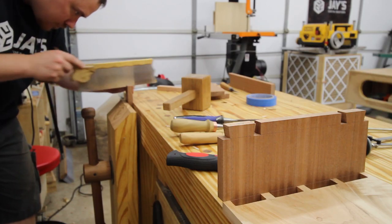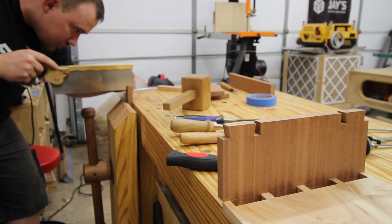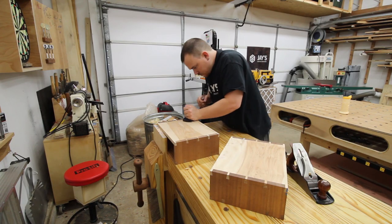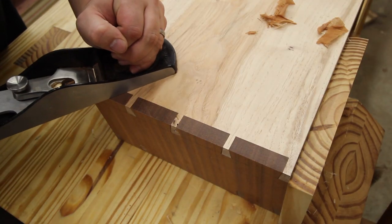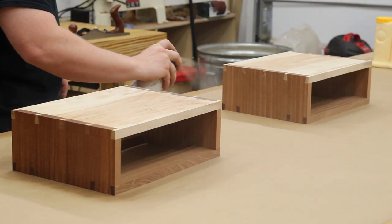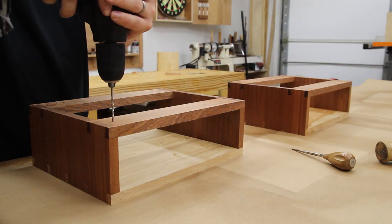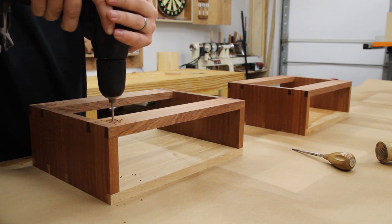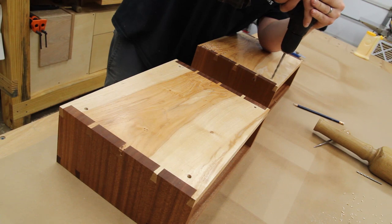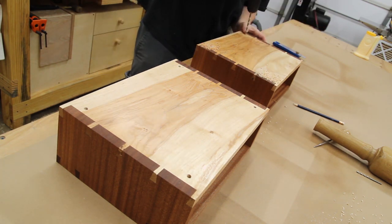The rest of this project is a lot of repetition — just making sure that the joints are cut in the exact same way and that they fit together securely as they should. Assembly was very uneventful, which is a good thing — just a little bit of glue to lock everything together once everything is properly seated. Then I could clean up all of the joints with a couple of hand planes and a card scraper. I used a can of satin spray lacquer for the finish, and to install it I had to drill a couple of mounting holes — pre-drilling in the small pieces for the screws, and also drilling through the shelf material with the smallest bit that would allow access for the driver, which was a quarter-inch bit.